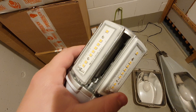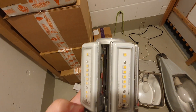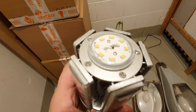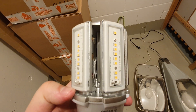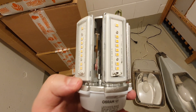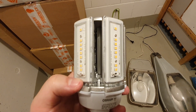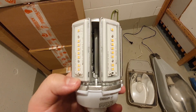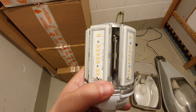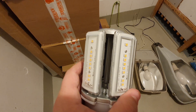I think that 50 percent of these bulbs may last the declared 50,000 hours, because that is how this norm is defined — 50 percent of bulbs surpass 50,000 hours. With such heavy heat sinking the LEDs should not burn out quickly. For comparison, filament-style household bulbs are declared at 10,000 to 15,000 hours, and other LED styles with a little more heat sink are declared for up to 20,000 to 25,000 hours — though many don't live up to that.